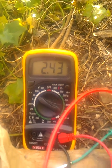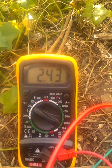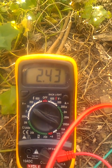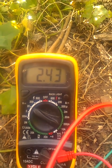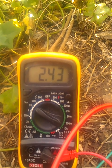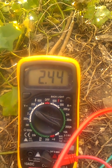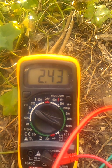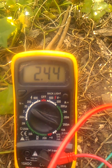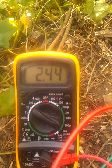Right now we're charging up this battery. We can watch it charge — it's a very small trickle charge. It takes about an hour and a half to two hours to fully charge this battery. We'll watch the volts slowly rise. Right now we're at 2.43, 2.44, and she's starting to tick up to 2.45. She'll slowly start to climb back up to about 5.80, between 5.7 and 5.9 volts.